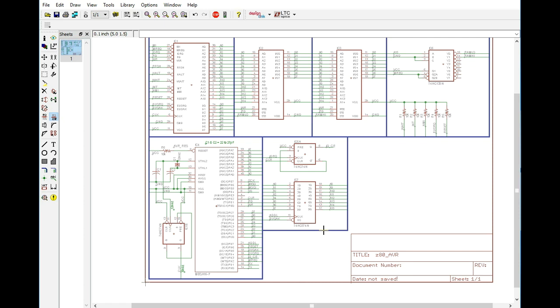Now, the two other things that we need to look at are the IO reads and IO writes. With the IO read, it's pretty straightforward. We do need to essentially do an IO function, which is going to set the IO chip enable and the wait state. And of course, we haven't put our wait state in here. We actually, or our wait line, we actually need to connect this right here to wait.